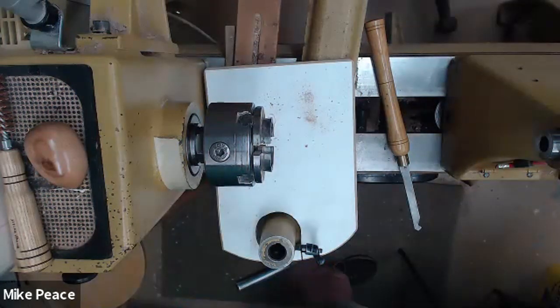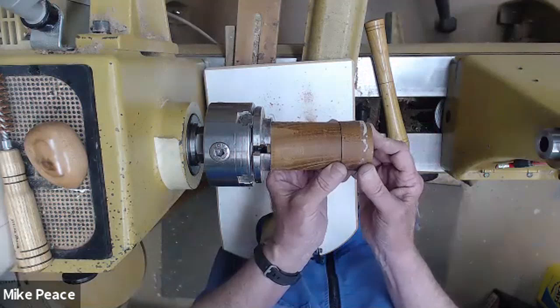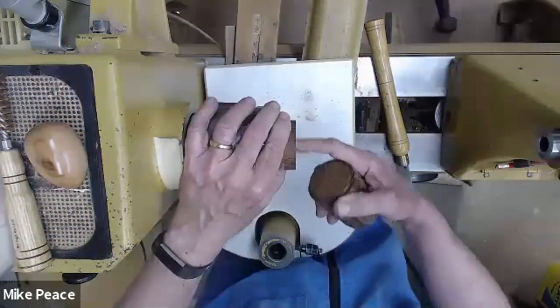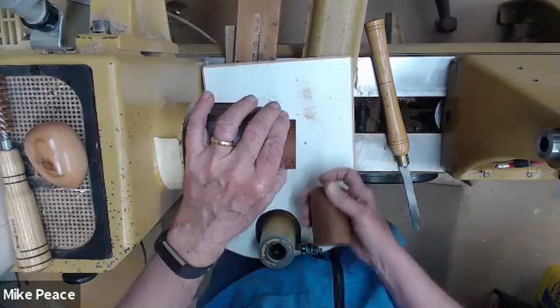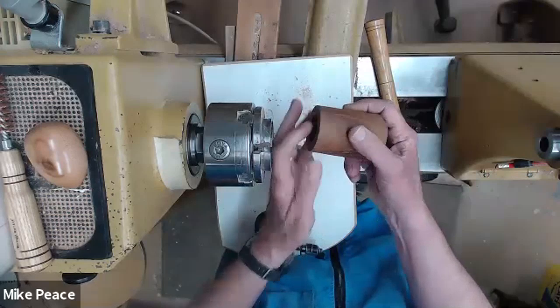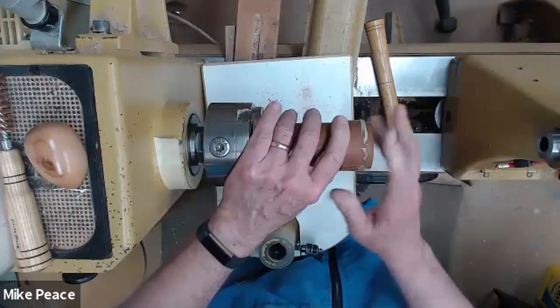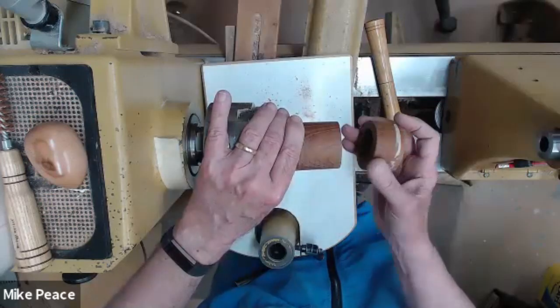They look like they're a lot of work, but I tell you, the more you use them, the faster and easier it gets, and it's so standard to use it for a box. Let's see if I have a box. I don't think I got a box blank here. Yeah, so let me just show you. So basically, okay, we got our box blank, and we turn it between centers. We decide which end's going to be the lid. That's the part we chuck in here. We part it off. We turn off the center, and we go ahead and make the walls parallel, and we take that off. Then we turn our tenon to fit that. We put this in here, and then we turn it to a very tight fit so we can finish off the top of the lid. And you've seen this probably done several times, but that's an effective use of a jam chuck where you're actually using the bottom of the box for the jam chuck.